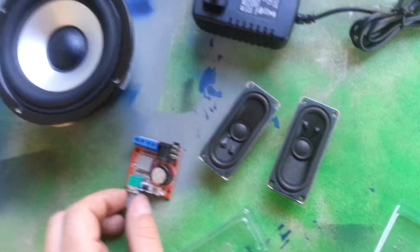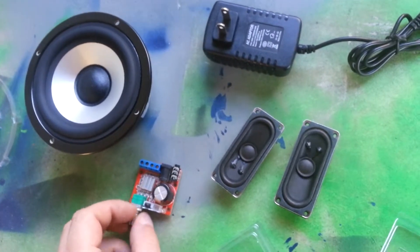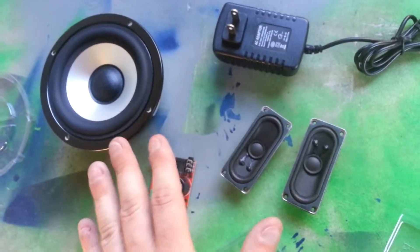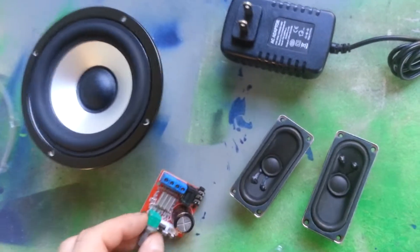I'm thinking I'll bridge these two to have the same output and run that to the subwoofer. That gives it the full 20 watts. And that'll still leave enough power for these. I know I've thought about whether or not that's going to draw too much power — I'm thinking it's going to work out. It'll reduce the amount of power going to the speakers, but these things are plenty powerful enough. I've built enough of these, trust me.